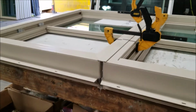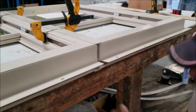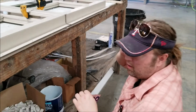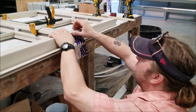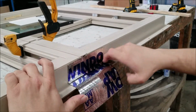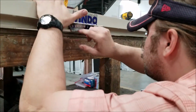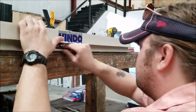So now I'm going to take my flashing tape. I can do it with my hands, but if you feel the need, a simple spatula like you use to apply tape and bed will work. You want to start at the top, make it nice and clean, walk it down, then crease it on the nail fin and roll it over. Work it side to side until you get it to where there are pretty much no gaps. This is where you might need the spatula.